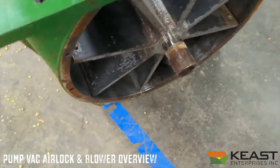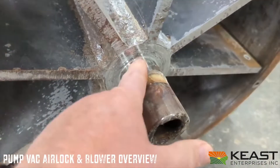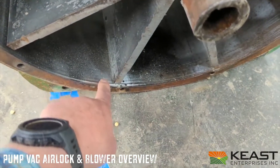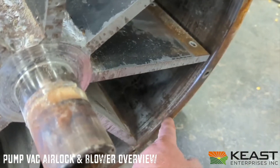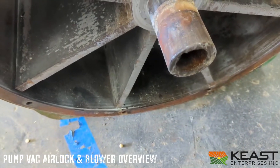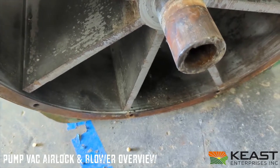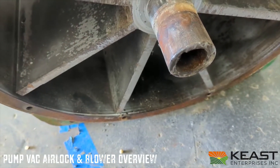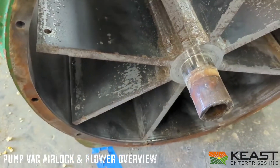Here is the other side of the airlock with the bearings off. We'll be replacing the bearings and the seals. You can see the tracking next to the end cap and a lot of scoring here. This airlock will go to a machine shop, get totally bored, and be as new when it comes back — new boring, new bearings, new seals to bring it back to life.